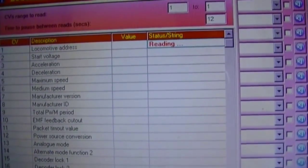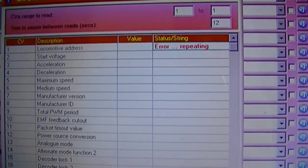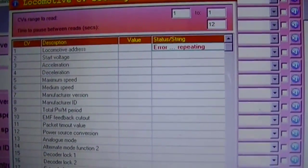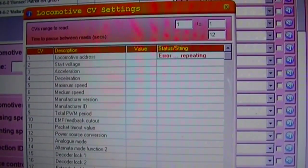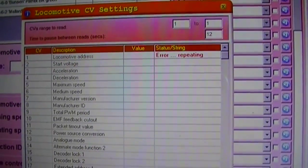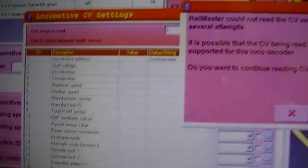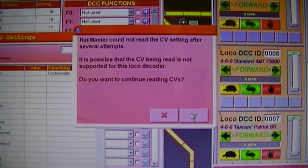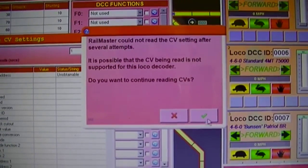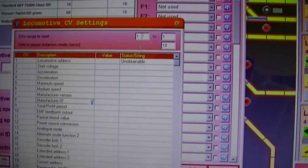This can come up with an error sometimes. If it does, either the rig isn't set right or the chip may be faulty — and we've got another one here that might be bust. A message comes up saying the CVs couldn't be read. What I'd suggest is checking the manufacturer ID and seeing if that returns, because if it does then maybe the chip just isn't set up right. Everything should be able to return the manufacturer ID. Failing that, we'll try a reset. The result comes back as unobtainable.